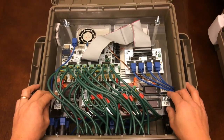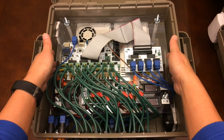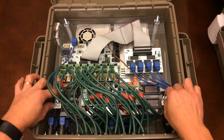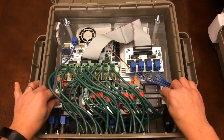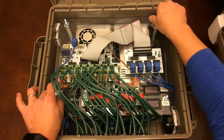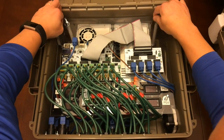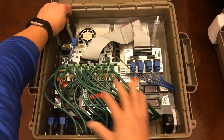So what I really like about this is there are two Lexan boards for the mounting plates, one for the top and one for the bottom. The one on the top holds all of the electronics. The one on the bottom mounts all of the power supplies. This box has four 360 watt power supplies, 12 volts, the generic kinds, and these wing nuts here just unscrew. Get these two here. So if you ever needed to do anything with the pigtails, anything on the top, you can address that. Network cabling is all here.